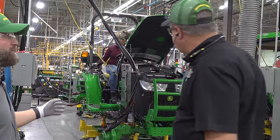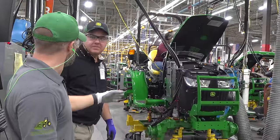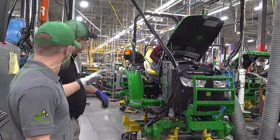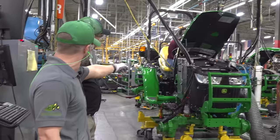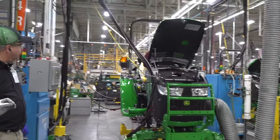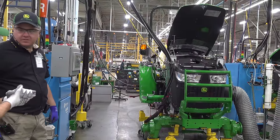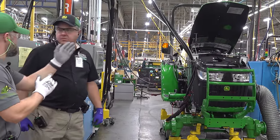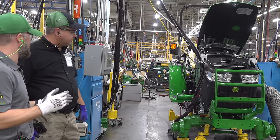This is one of our running stations — this is the first time we fire up the tractor. We've got a few things connected here. Our hydraulic fluid is connected so we do our fluid fill right before they start this process. You'll also notice that electrical cable — that's plugged into the controller of the tractor. On the premium cuts, because we have that electronic control unit, a technician is running it through basically a full functional check.